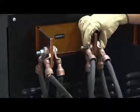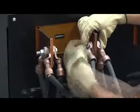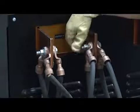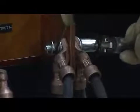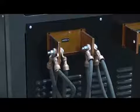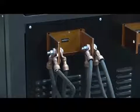First, place a washer on the bolt, then a hex nut, and then a final nut to screw onto the bolt. Manually screw the nut onto the bolt until it becomes tight. Tighten up the connection using the necessary tools to clamp it as tight as possible. Once complete, perform the same connections for outputs 2 and 3. This way each output will have a total of 8 cables connected to it, 4 cables per each side of each output.